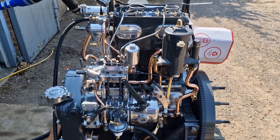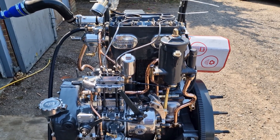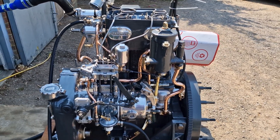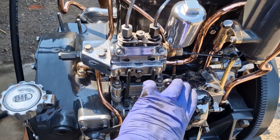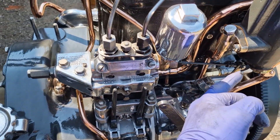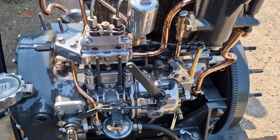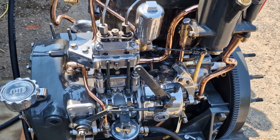Once it starts getting warmed up we can set idle speed, oil pressure, bits and pieces like that. And that should be it all done, so let's give it a go and see if it starts. So we're going to go for a start — we shouldn't need it today but we're going to open the cold start and you can see the rack went that way, so that's now fully that way. We'll just put the camera on the other side so you can see the exhaust and we'll give it a go.